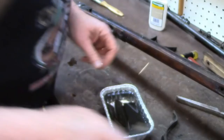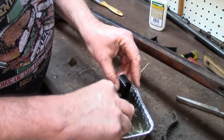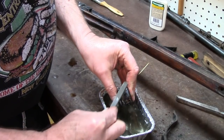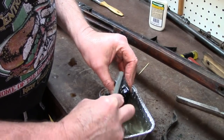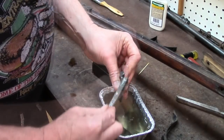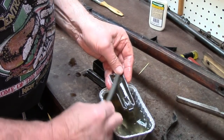We'll give those a good brushing. I'm going to let them sit here for a while but just work in the mineral spirits. Paint thinner is a different grade of mineral spirits — the same basic substance but refined a little bit differently. They both essentially do the same thing. Mineral spirits is usually the cheaper of the two. It's already cutting into that surface rust, and once it's worked in there I'll let it soak. All I'm doing with the brush is just helping remove surface dirt — it's cleaning up really nicely.